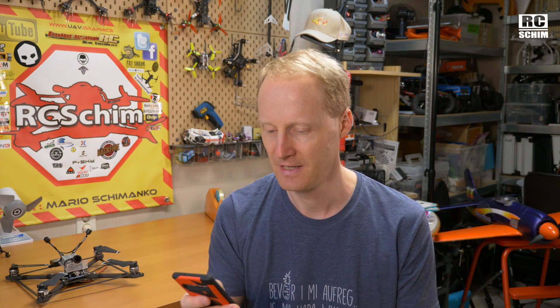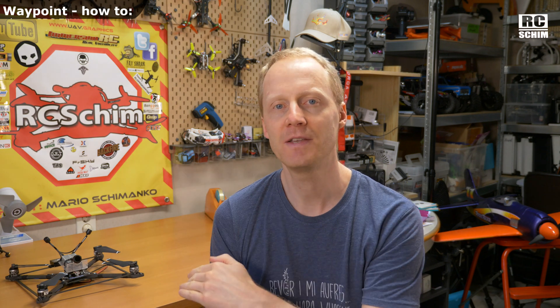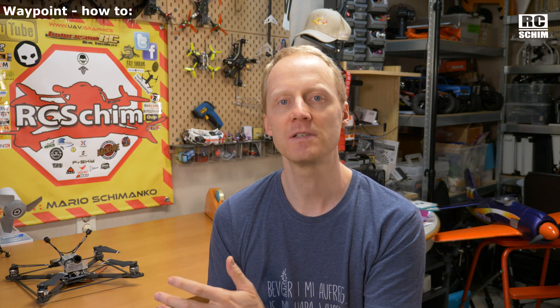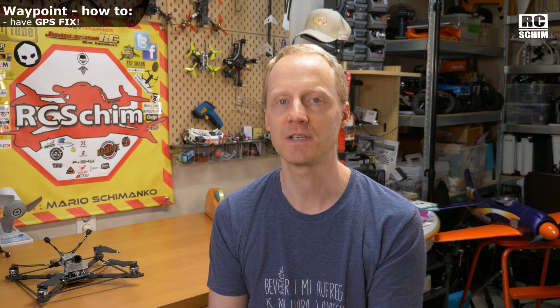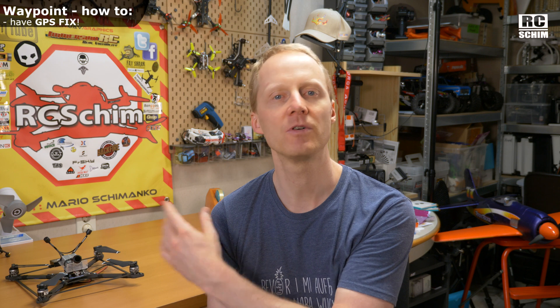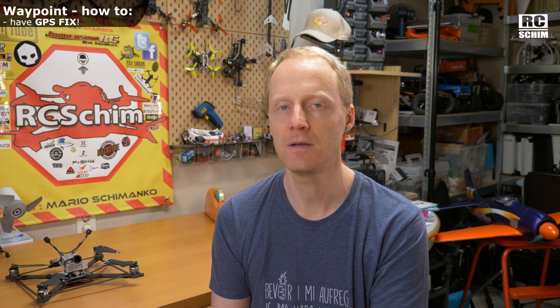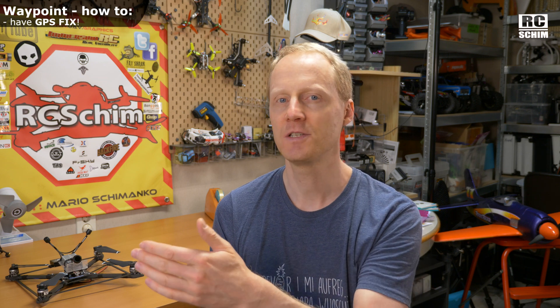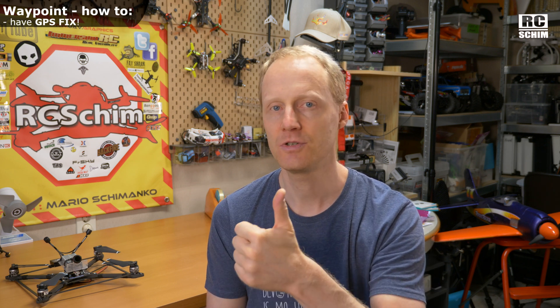So that all being said, let's check the list of tips that I noted — it took me quite some time to figure it out, to be honest. The first thing you need to know is that if you want to arm a GPS-enabled iNav copter, it has a lot of pre-flight checks and it won't let you arm if something isn't right. The most common thing that isn't right when you want to arm is you don't have GPS fix. If it doesn't have a GPS fix, a return to home wouldn't work and a fly-away could occur. So they decided to lock the arming feature until GPS fix is acquired. You can also see this when connected with the iNav configurator — you see a checklist showing which marks are red and which are green.